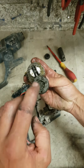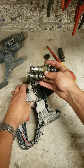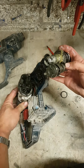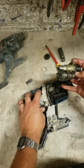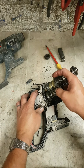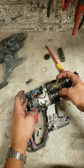Try to set it so the pins are parallel - we're in a straight line. Move your ears so they're straight up and down, and wrap everything in together. This should move freely; there shouldn't be any backlash.